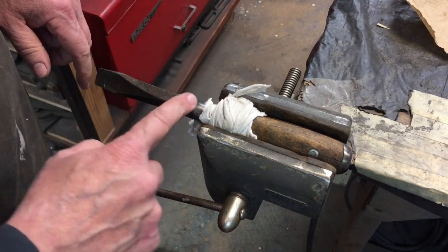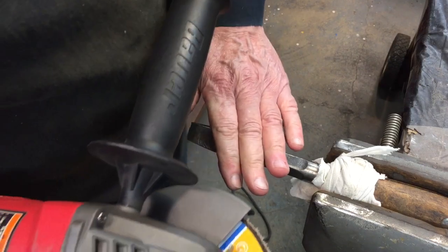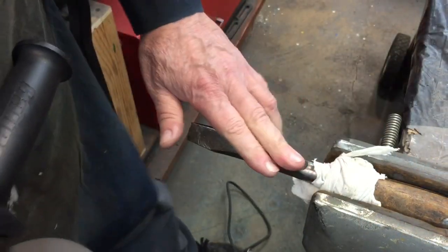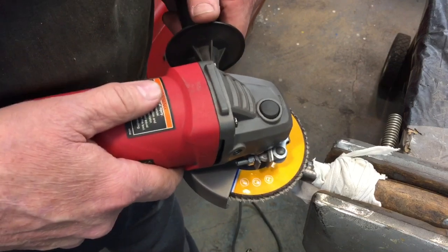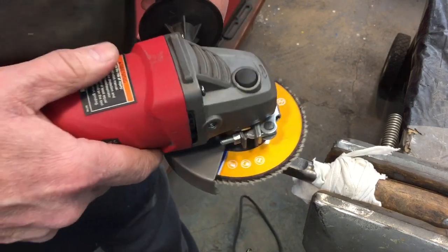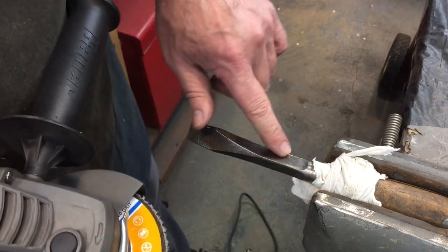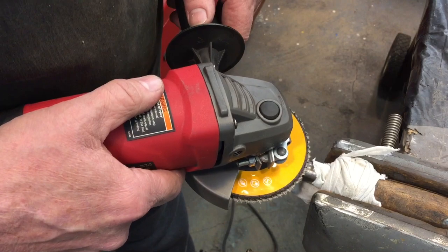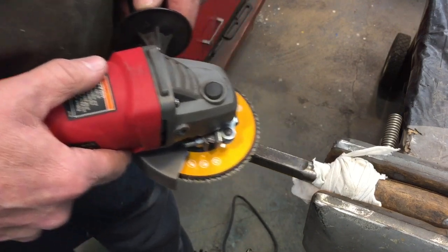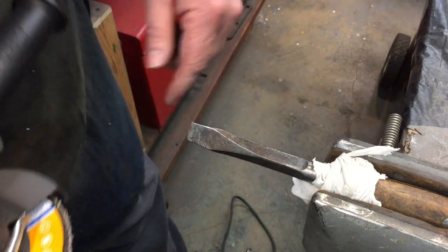We'll hit this top facet from that little bevel down, then turn it 90 degrees and do each one. Now this is important — the vise should be at belly button height. That's the perfect height because your elbows will be at a 90-degree angle and you'll just give it a nice spring back. When the grinder is running, you're going to slightly touch it and drag it this way. Lightly touch it and drag it. Then you'll see if it's shiny on one side, meaning you're canted that way. You want it shiny straight across. Once you've got it straight across, muscle memory will tell you where to hold it, and then you just touch it and lean back — you don't even have to use your arms. Touch it and lean back, all the way around.